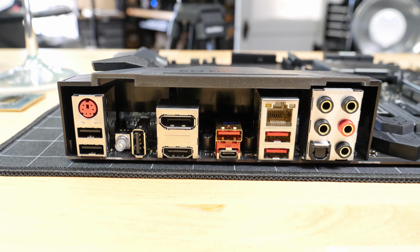Then of course the ASMedia, PCI Express x2 connected, USB 3.1 Gen 2, 10 gigabit per second USB ports, one Type A, one Type C. Our Killer Networks gigabit NIC, two USB 3.1 Gen 1 ports, and our Realtek ALC1220 based audio codec with an optical SPDIF port. So this has the SteelSeries Engine and the Nahimic 2, the MSI Gaming desktop app. It'll do Crossfire, it'll do SLI.